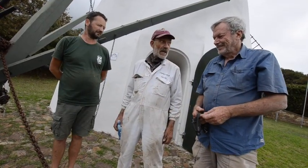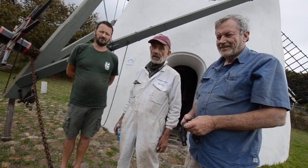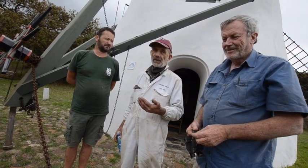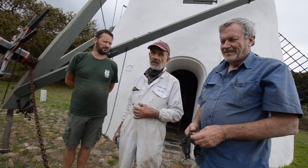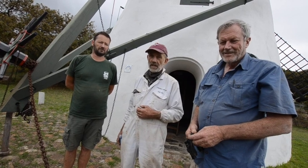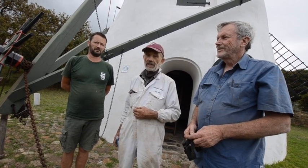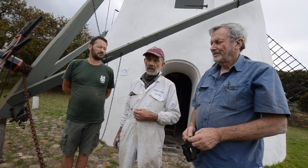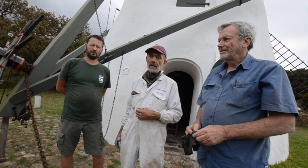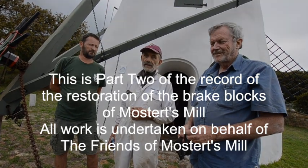Thanks to everyone for their help — we have really achieved what we hoped to do today. We've got a true radius on the brake blocks. From the stage that we started cutting on the furthest from the cutter, another 5mm of the thickness of the brake block has gone and we've got a complete 100% circle on the brake block, which is about 4 or 5mm in diameter bigger than our calculated diameter of the brake wheel. If there's still any drag between one and the other, we'll staple on some very coarse sandpaper onto the wheel and run the mill with the brake slightly applied just to true up one with the other.